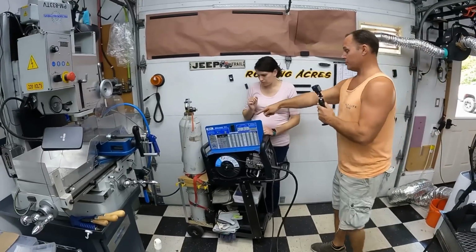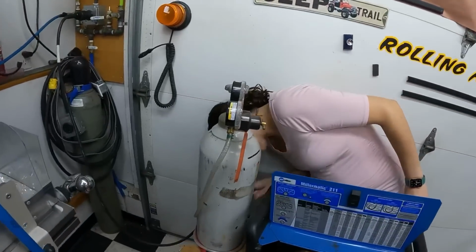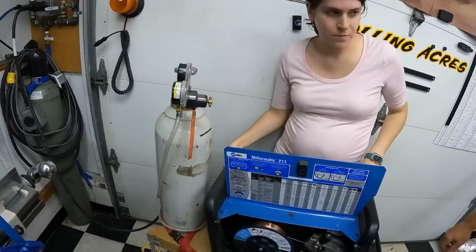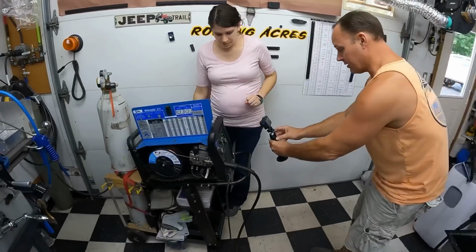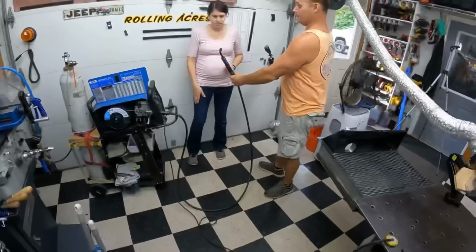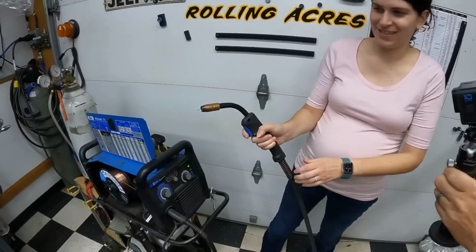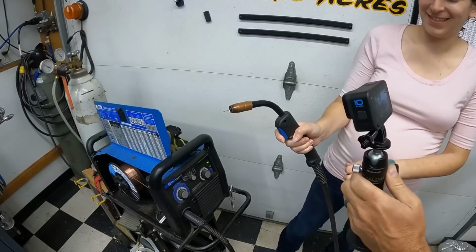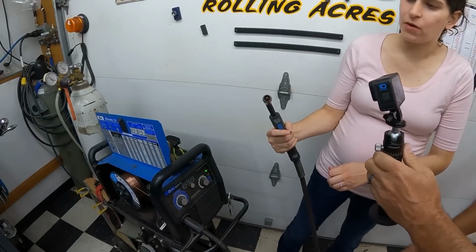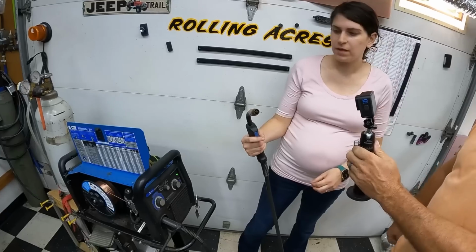You're all set. Now there's a switch on the back of the blue machine, right back here. It's a slow rocker switch, so turn it on. All right, so you're turned on, and now the lights out front have come on. So you're green and you're ready to go. You're going to pull that little blue trigger just for a second. Go ahead and pull it. Now turn it so you can see the tip of it, and pull it now. Oh, okay. So 2 things. You see the wire coming out, and you also hear that gas coming out. So pull it again.